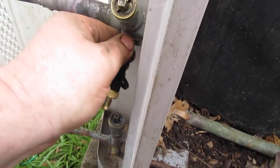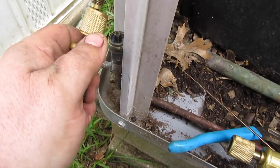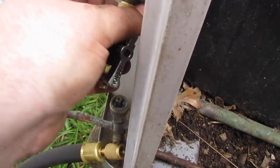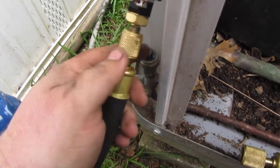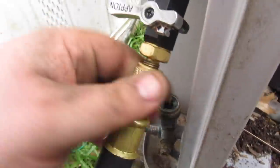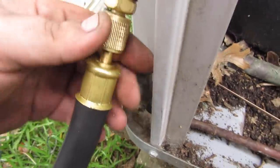It's still open to the line set and the coil as it is. We'll take our big Appion hose and hook that up. I had to put a wrench on it - I've never had to do that before, but it's tight now. I'm going to hook up the Micron gauge down here. I see a plug-in down there - I hope it's hot so I can work on the voltage.